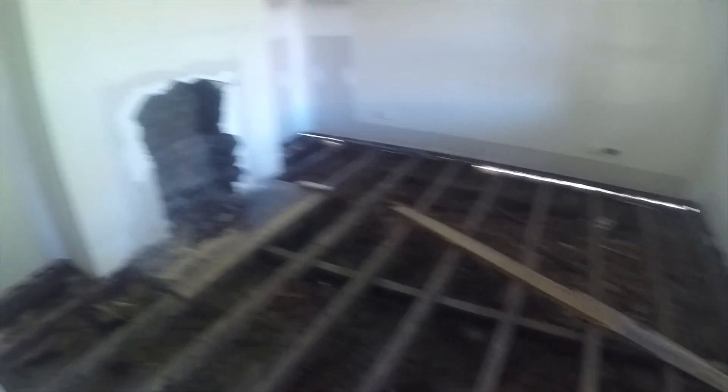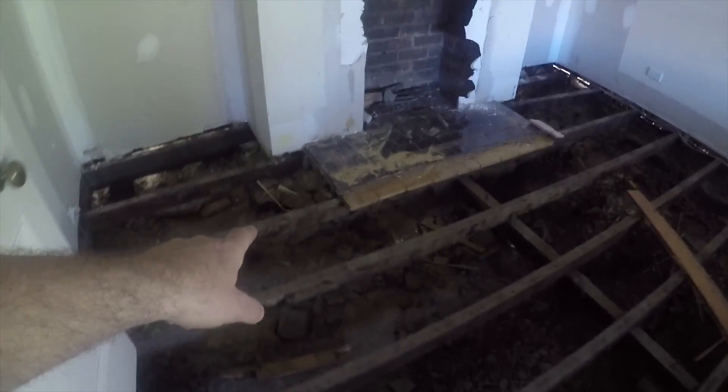Here's the other master bedroom again — fireplace. You can see here the stone; it's actually sitting on stone all the way along this side. Here: bluestone footing, stone footing. And the wall plate — there's nothing underneath this wall plate whatsoever. That's actually sitting straight on top of the stone. The timber itself has actually held up pretty well — that is a really good sign of the strength of the timber.